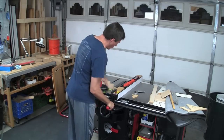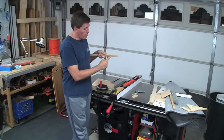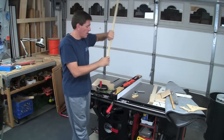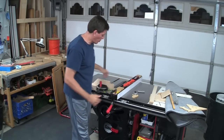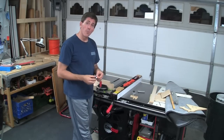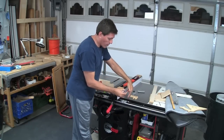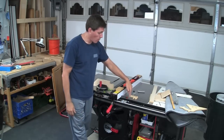I'm going to set this fence to do one of my shoulder cuts. Let's say I want four inches from this end of the board to where the shelf is going to be — so this is the lower shoulder cut. My next cut is going to move the fence further over to make the next cut further up the board. So I'm going to set the reference point with the KM1 to the long dimension, set a stop block, make my shoulder cut, then flip the KM1 to the short distance and scoot the fence over for the second shoulder cut.